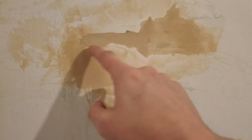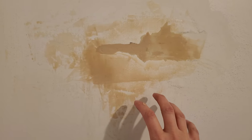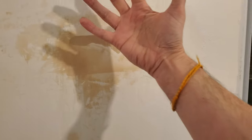As I went further I discovered there was a huge gap behind here. In this area, probably behind here, is the four-inch vent pipe for the plumbing in the house. There's a coupling between two sections of ABS which had a thick rubber sleeve that stuck out, so I couldn't get a piece of drywall over it. I filled in the area with mud and covered it up with tape.